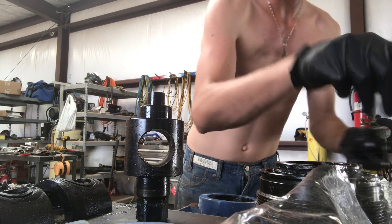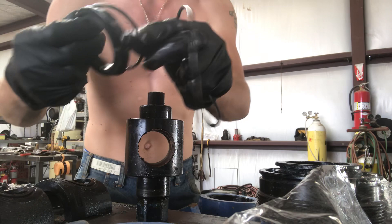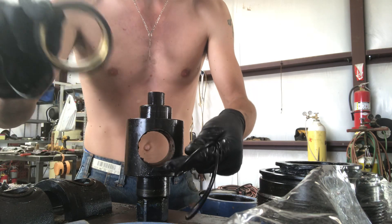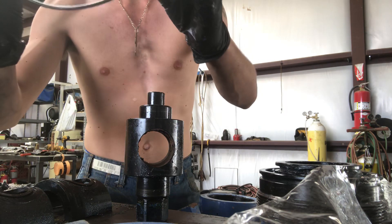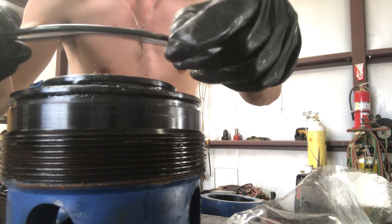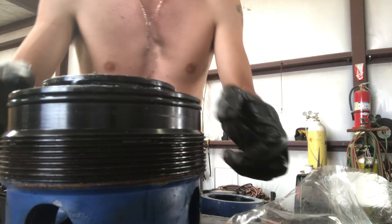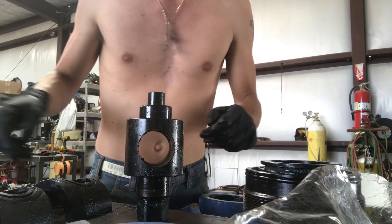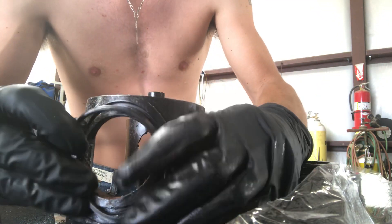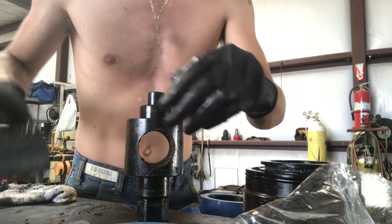For purposes of the video this valve has already been broken down. Take our soft kit — we got two small o-rings, two brass seals, a large o-ring. Take your retainer, take the large o-ring, pop that in the groove on the outer edge of the retainer — it's the base of your plug valve. Set that off to the side. Take your sleeves, stand that up, push the o-ring into the slot on the sleeves.